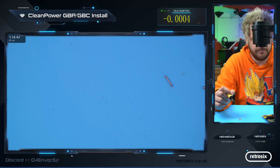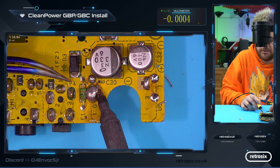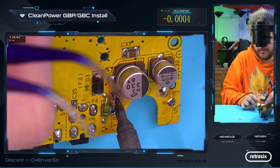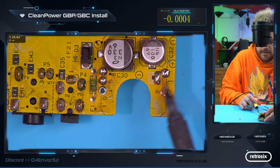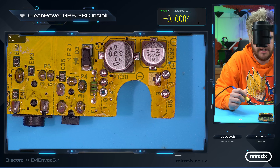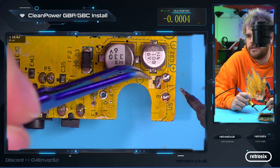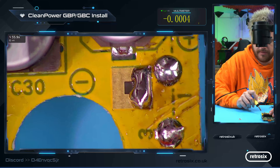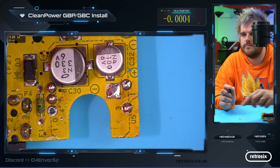Once you have the old regulator out, this can be reinstalled — let's place that to one side. To clean up these pads, pretty simple: just clean your iron in some brass wool. If there's a lot of solder, you can tilt the board up, warm it, then knock the board and it will roll off — you'll get a nice hot blob of solder to move out of the way. You can use de-solder wick to remove excess solder. Just make sure this is a ground pad and this is the power in — you don't want a join over these two pads. That's important. Flatten this pad out, spread the solder out and thin it, clean the iron and remove some. And there we have the pads ready to solder to.